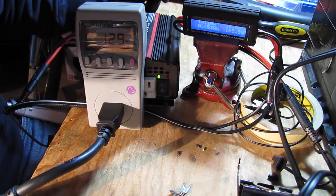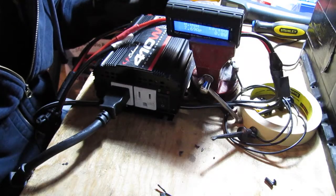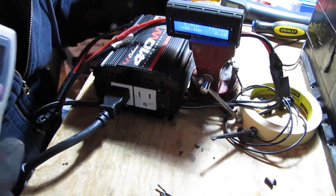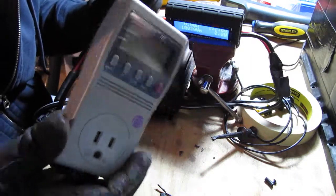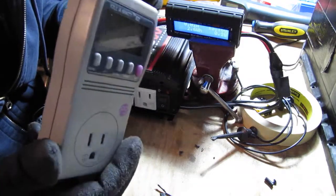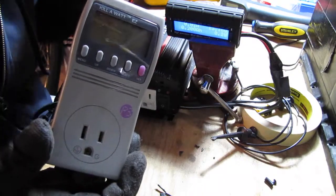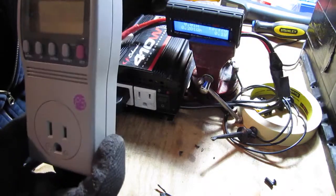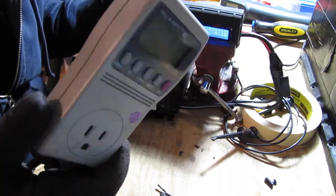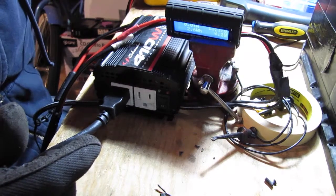Let's see if I can reproduce that — yep, 11.3. Alright, I'm back with an even bigger battery. It's like a 150 amp hour battery that's off-screen. I had to run these down on the floor — it's pretty heavy, like 100 pounds. Apparently the kilowatt meter does not like modified sine wave voltages. I kept getting zero as a voltage reading — of course, it then can't do the math if I throw it some loads. So this is out of the question right now.